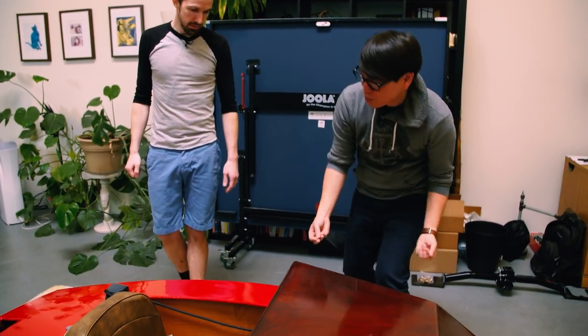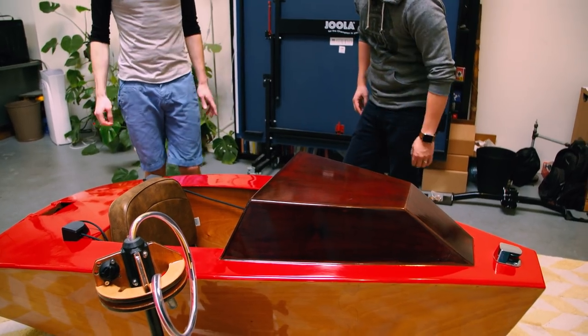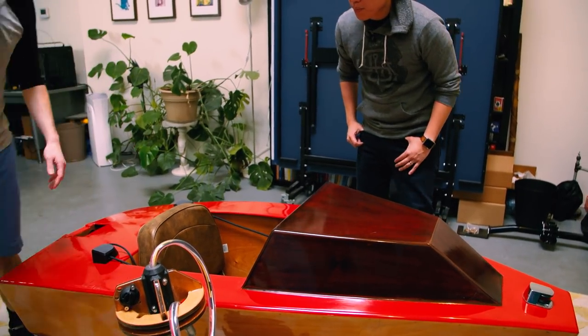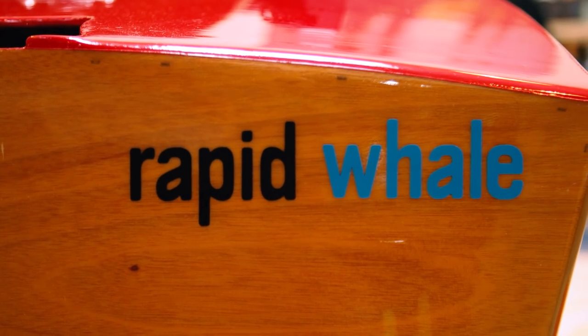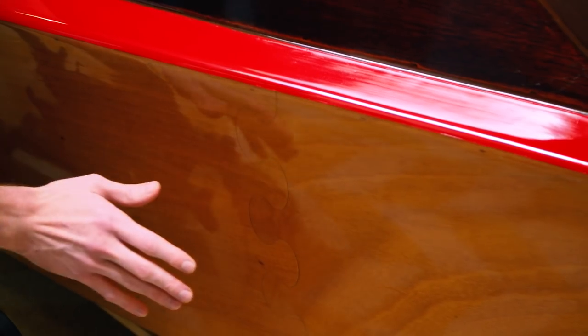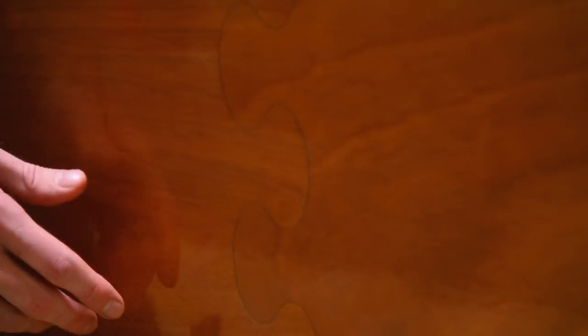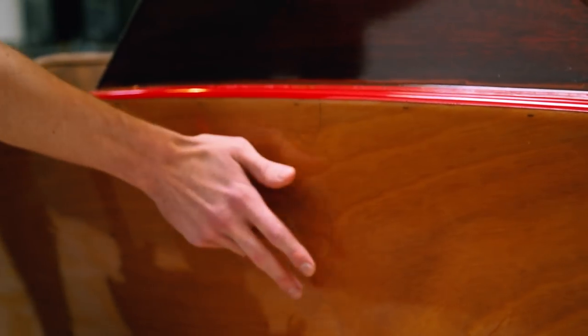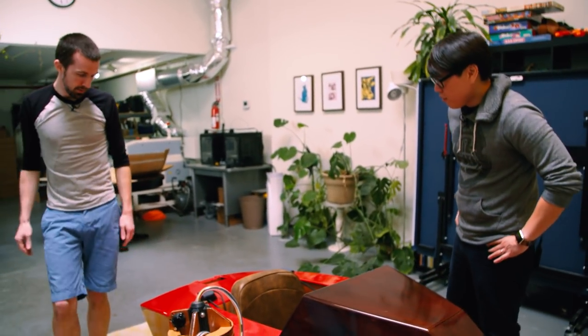The coating on the outside ensures it doesn't wear in water. On the outside we've got fiberglass, wet out with epoxy that turns totally clear — you can actually see the fiberglass texture up close at certain angles. Then you throw a few more coats of epoxy on, sanding between each coat. For your final coats, you do varnish because epoxy has to be protected from UV rays.